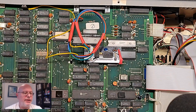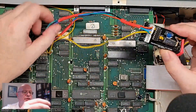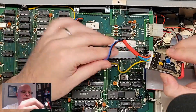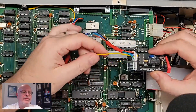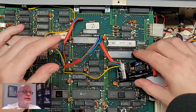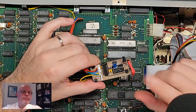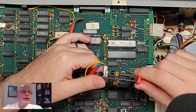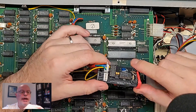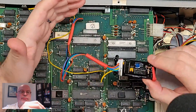That's basically the board. I have a new board coming with all the corrections, and I want to make a new wiring harness instead of all these separate individual wires. The nice thing with the current one is that they're stranded wires so they bend nicely — solid core could break over time. This is my prototype and it is working. I'm looking at setting something up like this for the Apple 2 and my Coco 2 computer, so look for those in the future.